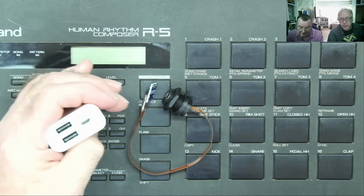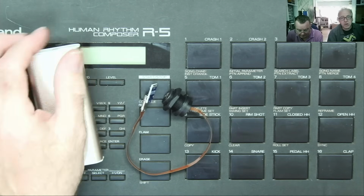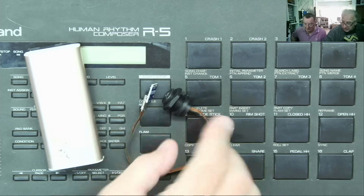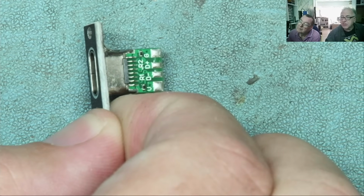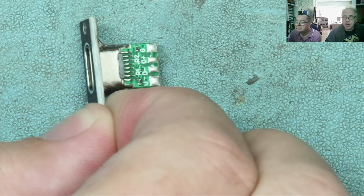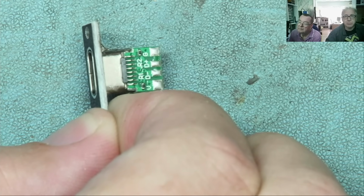Yeah, I see. So I thought, okay, can I get a solution here that only runs on 5 volts? So make the Roland run on 5 volt. And I take it you're going to generate the plus and minus 10 from a 5 volt supply. Indeed. And for this, we can switch the connectors. So I got this little USB-C connector here, and you see the little resistors down there, the R1 and R2. These are there to tell the power supply, if it's an intelligent one, please give him 5 volt with something 1 amp or something. Yeah.